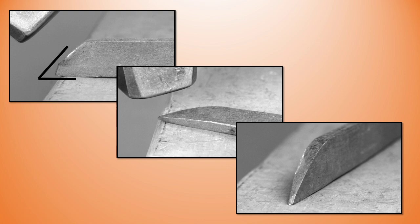For the blown-over beveled leaf scroll, create a short taper on the end of the bar. I'm not caring about the length of the taper — what's important is the angle. If your taper is too long you're going to have a very thin and weedy leaf and it's not going to look right. I draw that taper out to bring it down to a strong sixteenth of an inch at the tip. If that top surface is curved, that's handy — leaving it curved is going to be good when you make your leaf.